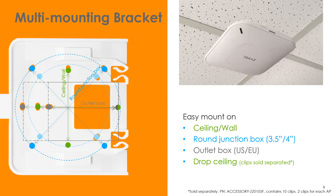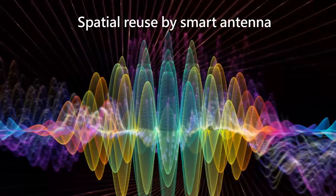I'll talk a little bit about smart antenna for those who may not be familiar with it. Smart antenna technology has been designed to help in two ways. One is it allows the AP to adapt the signal to where the individual user is — focusing the signal toward that user for a stronger connection. The other big benefit is the ability to avoid co-channel interference.